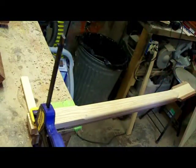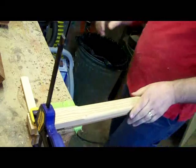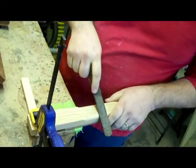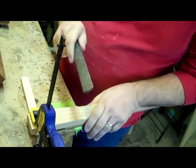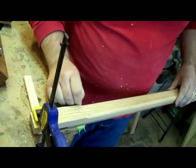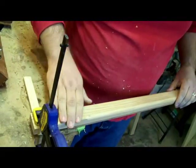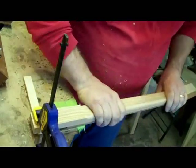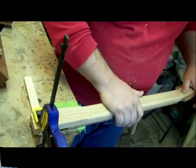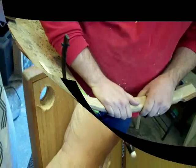You can see that's pretty fast. If I did that with a rasp or a hand plane, I could have spent 30-40 minutes or longer shaping that the way I want. Now really all I have to do is do a little touch-up, get some of these little edges off with some sandpaper. And this neck is really basically about finished. We'll tidy that up a bit and move on.